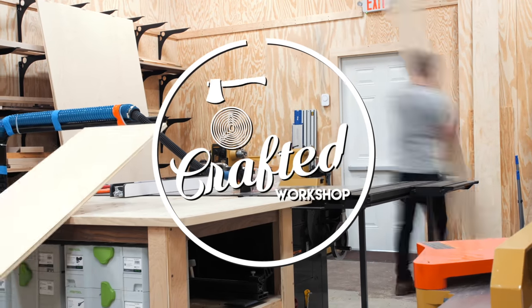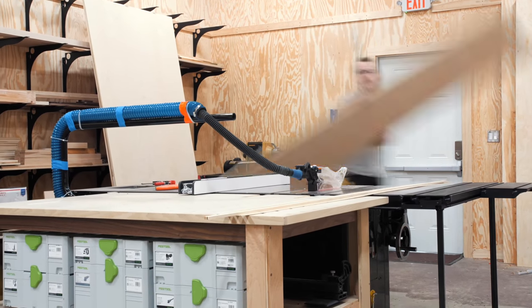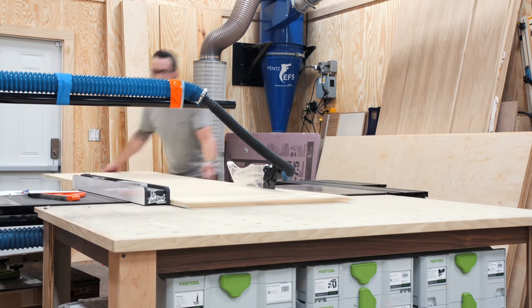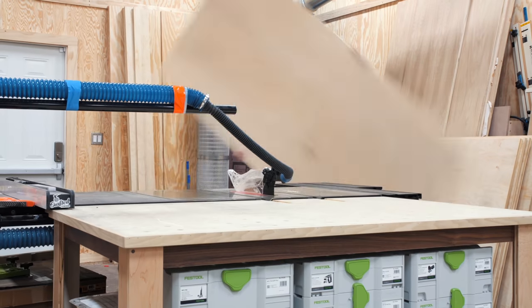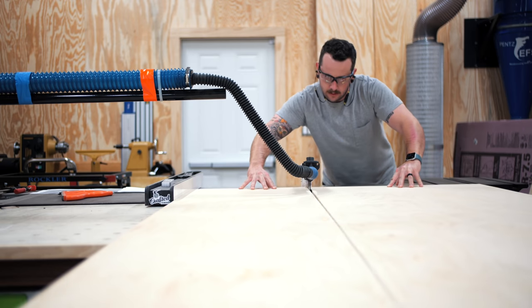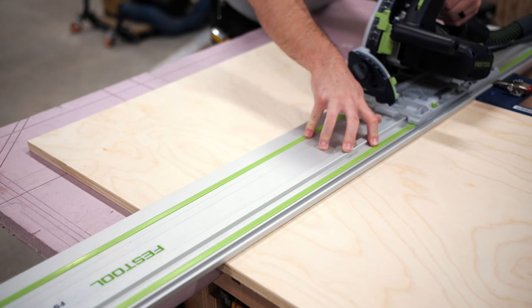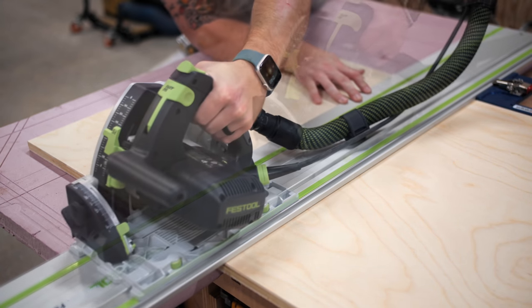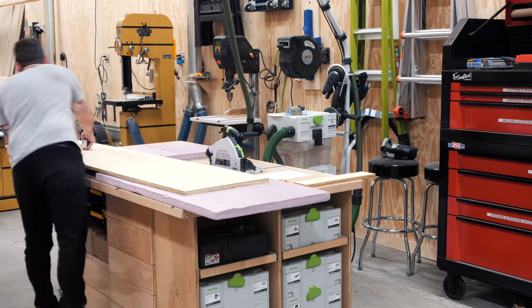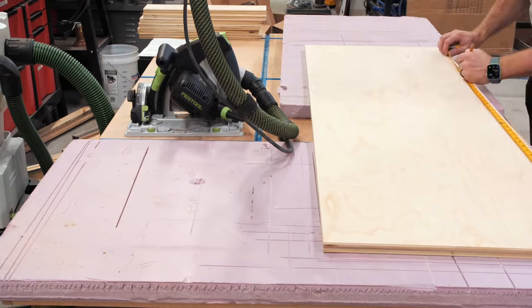I started this project by breaking down a whole bunch of plywood. In total I used a little more than eight sheets of three-quarter inch plywood for the cabinet carcasses, drawer fronts, and doors, and then another half sheet of half-inch and quarter-inch plywood for the drawers and sliding doors. I started by ripping the cabinet sides to their final width at the table saw, then cut the panels to length using my track saw. I was breaking down parts for the closet cabinet that will live in between the two Murphy beds.